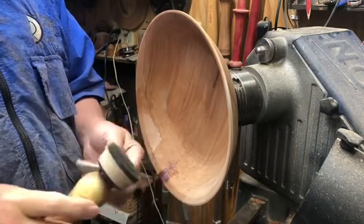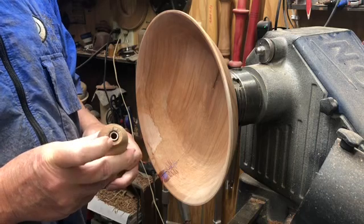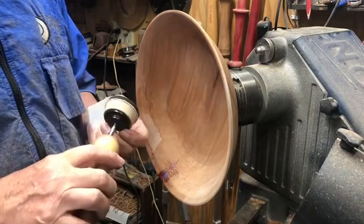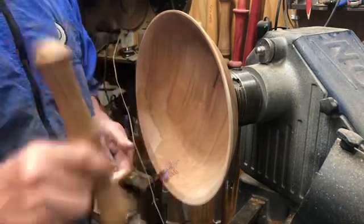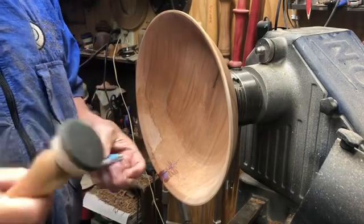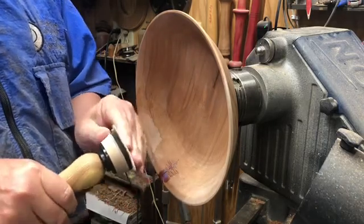I made this one. Inside here is a brass sleeve, bushing sort of thing, and underneath that is a magnetic bearing. So I can put that metal mandrel in there. I drop it in, it clicks in. It will not fall out unless I pull it out. It doesn't take much to pull it out. I could get several of those. But there again, you just take that same sandpaper, stick it on there. Here we go.